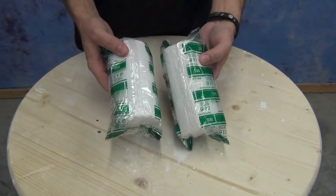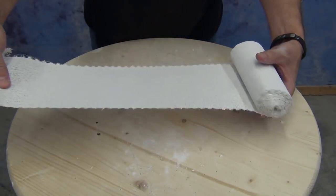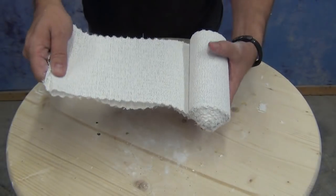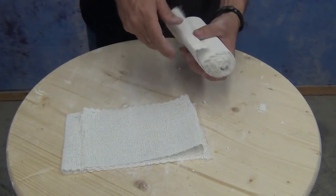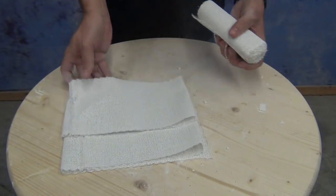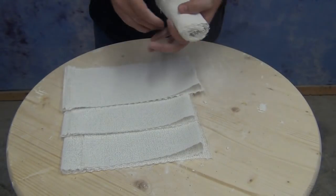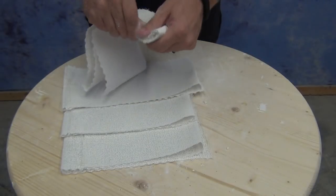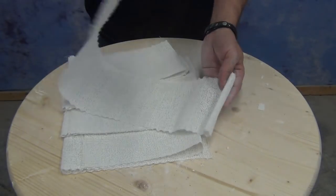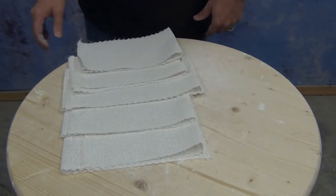Since this is going to be a layup mold we're going to trowel it on with our hands, so I need to make a shell later on to reinforce it and hold the shape, since that flexible mold will not hold its shape on its own. I'm going to use plaster bandage material to make a shell. I always like to prepare these bandages by layering them at least three layers thick and set those aside so they're ready to go, because in the middle of a cast the last thing you want is to be opening bandages and cutting them.